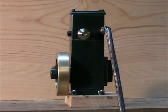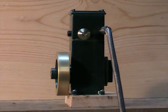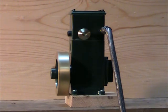It uses a special valve. It has a cam-driven intake valve — it's a poppet valve — which admits air into the piston. And then it has a spring-loaded slave valve, which is pushed aside by the incoming air to let the air into the cylinder, and then when the intake valve closes, the spring returns the valve to an exhaust open position, so the exhaust is open for the rest of the strokes.